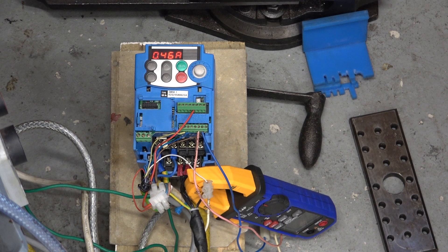My welding rotator is a fairly new toy and I've been driving it using the inverter from my shaper. I will get an inverter for the welding rotator later on when I'm ready. And if you've been following the channel, you know I've had some problems with overload tripping — the inverter was protecting the motor because it thought it was drawing too much current.